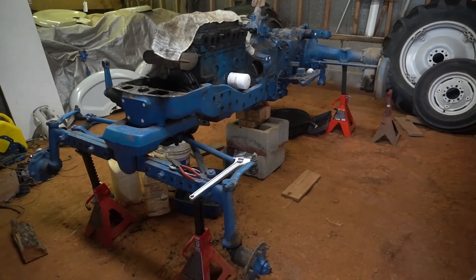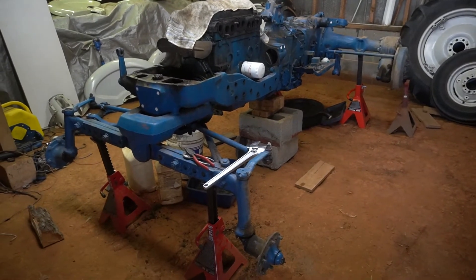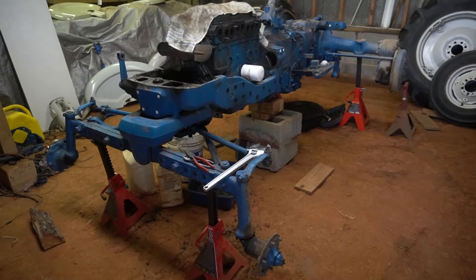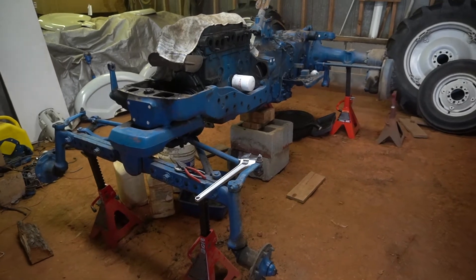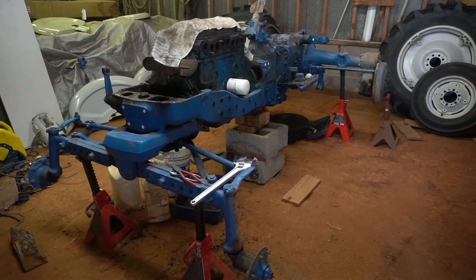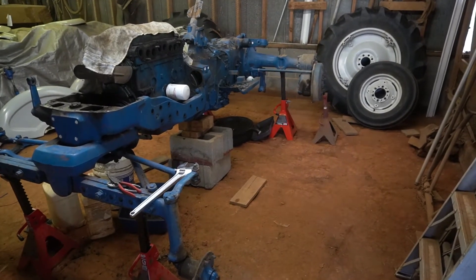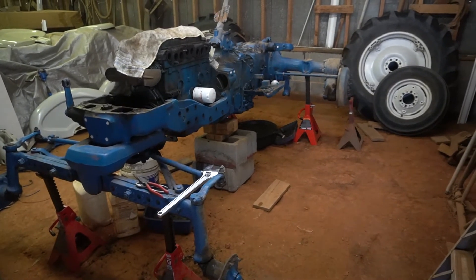Okay, so here was day three's progress. A whole lot didn't get done due to the simple fact I had to build a boom pole to help me, because my old one's just not strong enough to lift this tractor. Plus I had to go buy some new jack stands. The ones under the rear axle are actually 12-ton stands, and the reason they're 12-ton is simply because of the height. That stand next to it is actually a six-ton stand — it will not extend high enough to reach that axle.